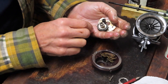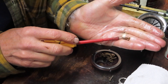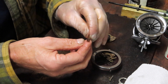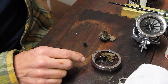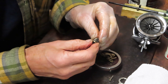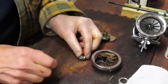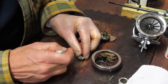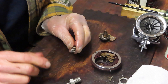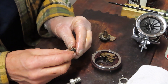Here's what I was referring to with the dog. That spring is lodged in a hole drilled in the anti-reverse dog — they do that because of the way this overrides and lets you back off the anti-reverse. That goes into the parts tray. We're going to examine the pinion gear, make sure all the teeth are uniform and not bent. If a reel feels like it's grinding, chances are the teeth are out of alignment on either the pinion gear or the main gear and you'll need to replace those.